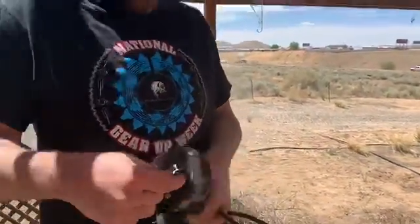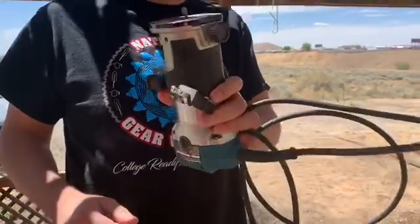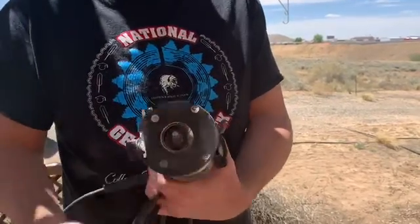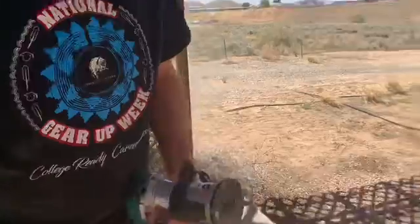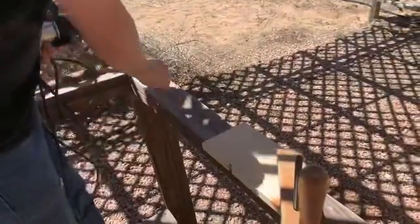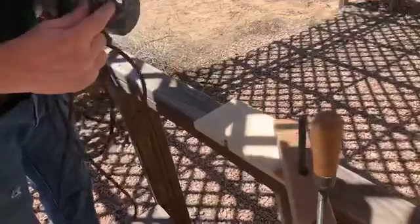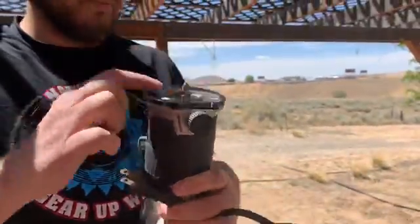I can use a laminate trim bit, it doesn't have a bearing. Some people call it a pin bit. It just rides along this rounded piece of metal on the end, and that will easily fit in there. When you do that, you want to make sure that the material that's left there is thin enough to fit through that groove, which it is.